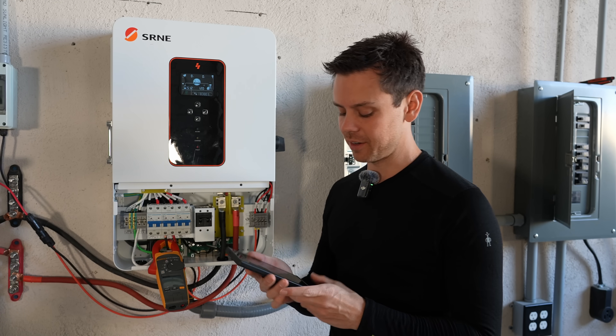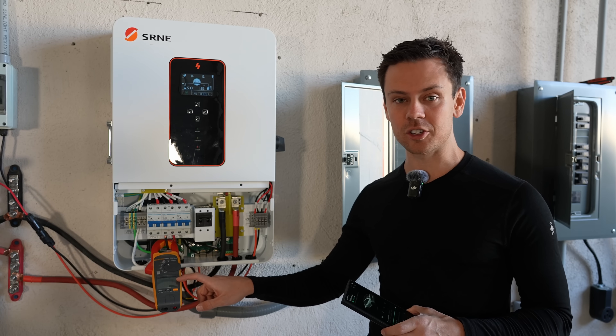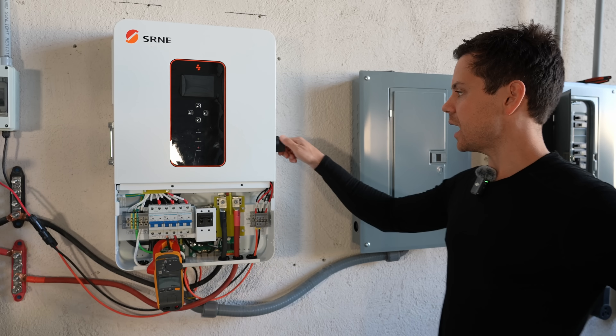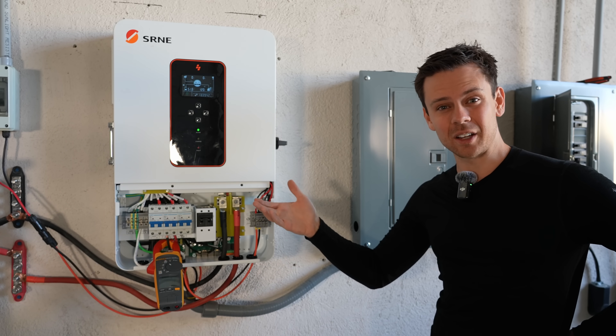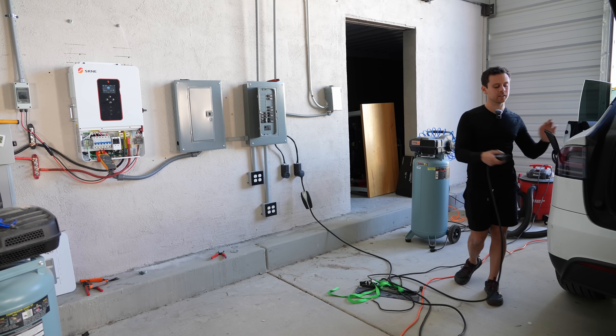Let's lower it. I lowered it to 26 amps and on the meter it shows 26.9, and the beeping went away. Let's add solar - now we're charging with solar and still running the load. The fan noise is about the same - pretty dang loud. The battery is at 100% state of charge and it passed the test. I ran it for almost three hours.